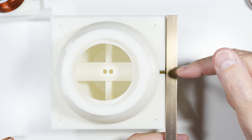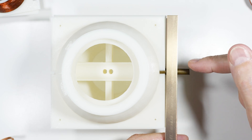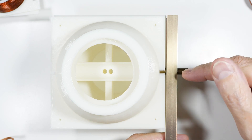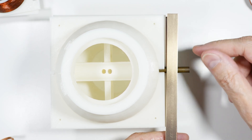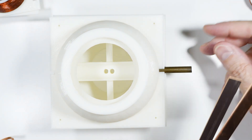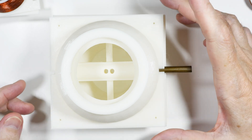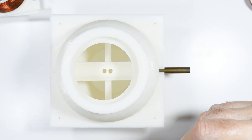The disadvantage of the metal strip system is twofold: first, there's friction and it starts wearing through — brass on brass, steel on brass, whatever you're using will wear down. The other problem is noise, because any friction contact with electricity is going to create static. So as David pointed out in the comments, he said to look at what Westinghouse did instead.